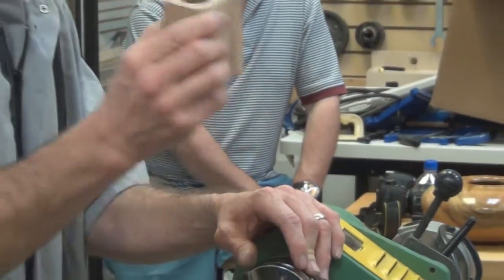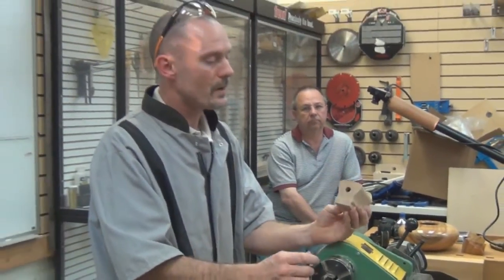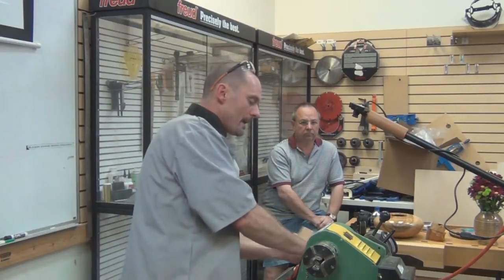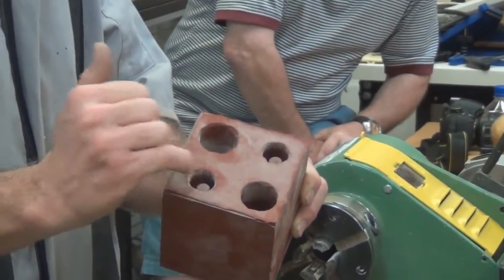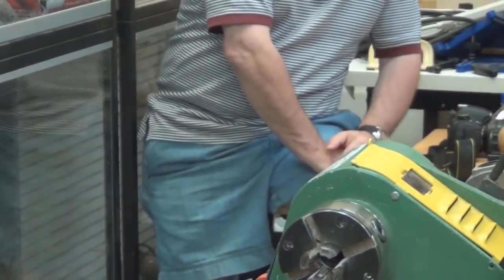And then the last thing is, it's not going to come out of here real easy. What I did was, once it was cooled, I just drilled a hole in the bottom, took my knockout bar, and just pounded it out, and it came out pretty easily then. Obviously the mold is a one-off. Subsequently, I've made myself some molds. And these ones I can use to either pour a straight column or a cylinder tube. And that's what I'm going to work with here.